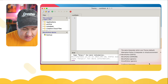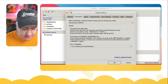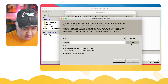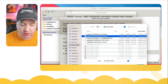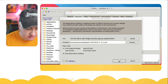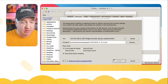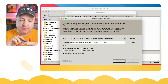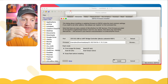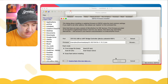Back in Thonny we're going to do the same thing again — click on the bottom and this time choose MicroPython ESP32 as the interpreter. We can then go to 'Install and Update Firmware' like before, find the firmware we just downloaded for the ESP32, and click the serial port button. If it doesn't detect the board when you first plug it in and reports an error, disconnect the board, hold down the boot button, reconnect the power while still holding it, then click Install again — this time it should detect it and start flashing.